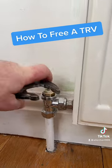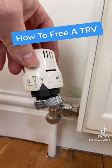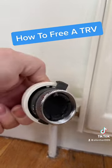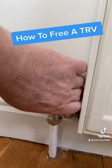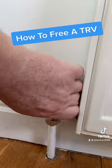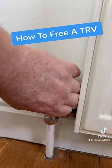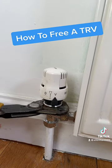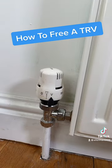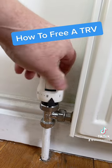To put your thermostat back on, make sure it's turned on full so there's less pressure on the spring. Put it back on, tighten it back on, then just nip it on a tiny bit with a spanner.